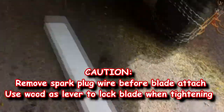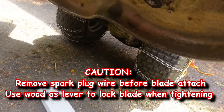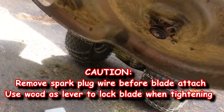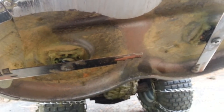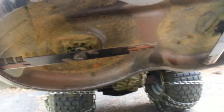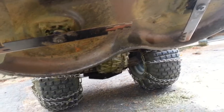I'm going to go ahead and put the blades back on here and get this back on the ground. I went ahead and lubed all the zerk fittings and oiled some other spots — yeah, while you're under the hood. If you've got a mower with two blades, be sure they aren't going to smack into each other. You want to normally set them at 90 degrees opposed, approximately.